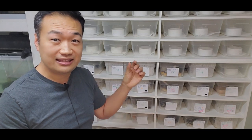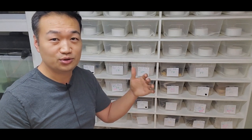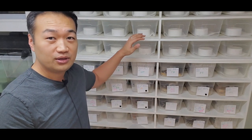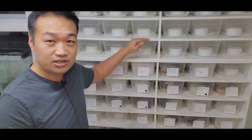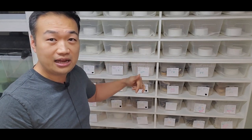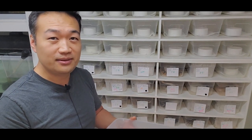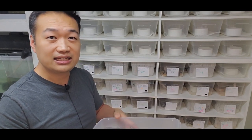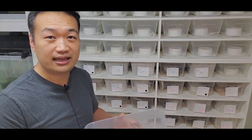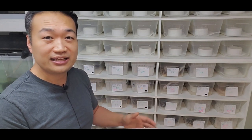For the top and bottom level shelves, add one more inch to account for the thickness of the side panels — half inch on one side, half inch on the other, totaling one inch. So if you have 33-inch interior panels, the top and bottom would be 34 inches. The last measurement you need from your tub is the length plus a half inch — that gives you the total front-to-back width of your rack.